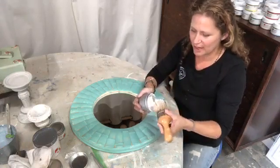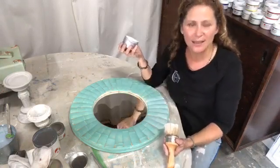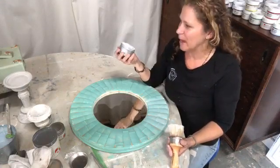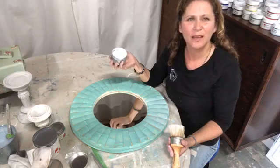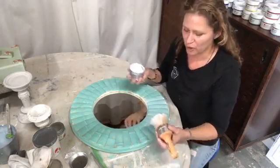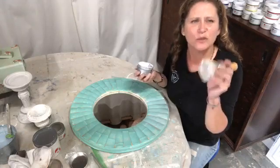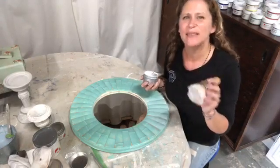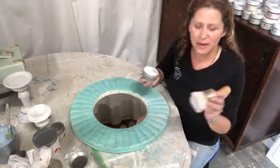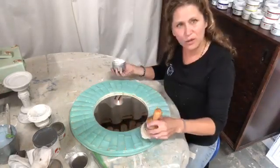So I'm showing you guys today, for those that are just tuning in, how to use white wax and antiquing wax to transform your furniture and give it more depth. I'm using candlesticks in this mirror because it's not so easy to be moving around furniture, but you can use it, of course, definitely on furniture. So it's all about the details and all those little nooks and crannies and crevices. What you want to do is get the wax in there and then wipe it off with a dry lint-free cloth, and woof, I mean, the transformation is wonderful. It's amazing. All right, so let's try doing this one here.